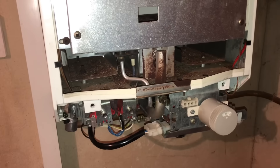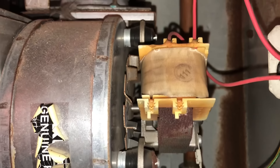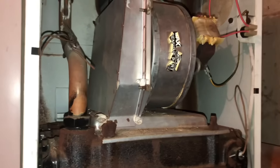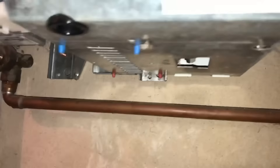There is a slight noise which is the pump spinning in the airing cupboard next door, but when I turn this on and hold this near the fan you can hear that faint buzzing. The first thing that needs to happen before your boiler will fire up is the fan needs to spin. If the fan is not spinning the boiler won't fire — and that's due to the air pressure switch which is on these at the back there.